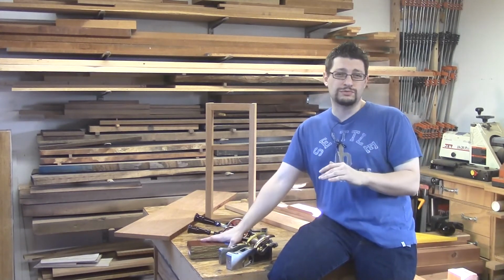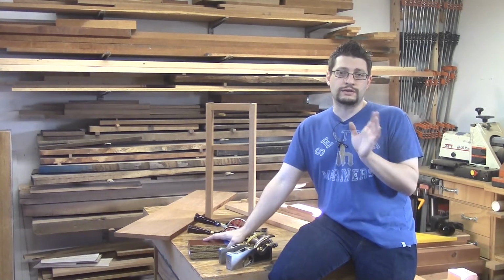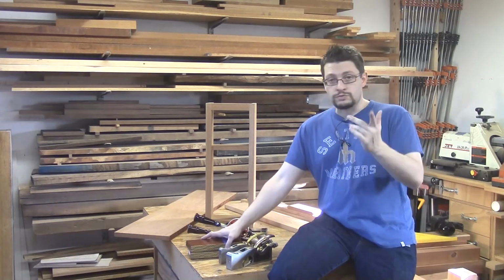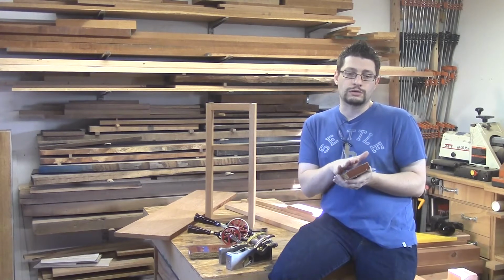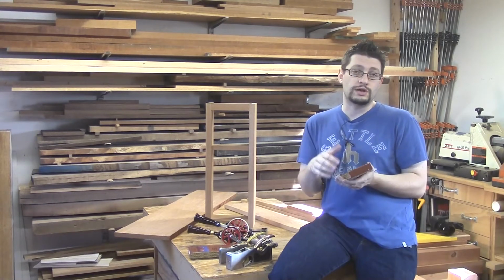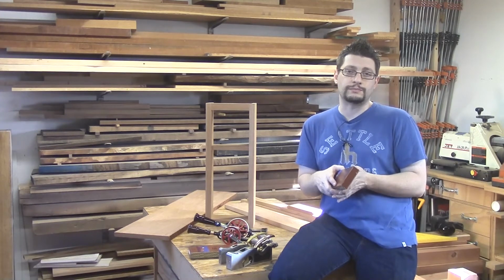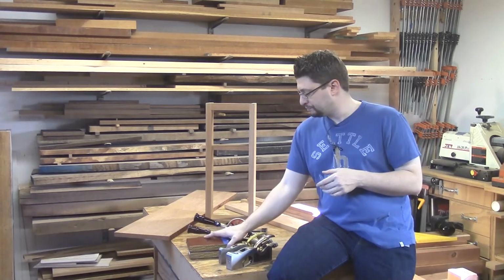But I'm definitely going to move to these now with my 8,000 Norton as the last of my Norton stones. And the other reason I wanted to move over to these two was they're supposed to stay flatter longer. The Norton stones, at least the ones I have, I'm constantly reflattening them against my diamond plate. So that was really cool.